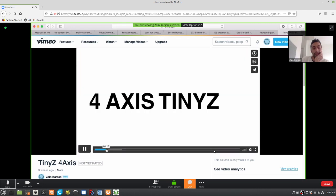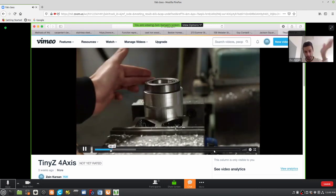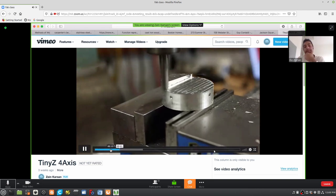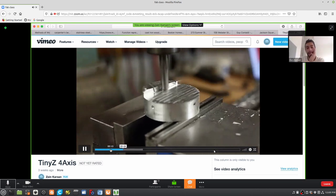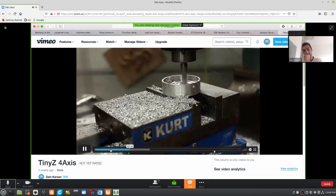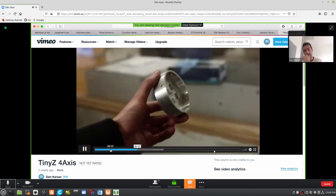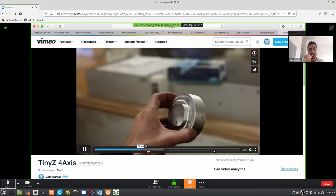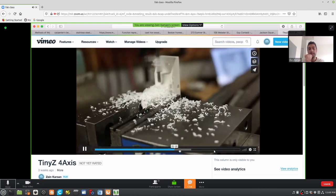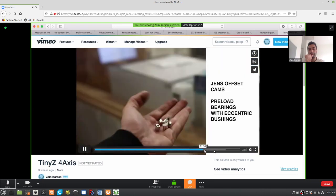So this is taking the bed of the machine. Oh, okay, so there's a preamble, which is if your 3D printers stop working, you can always just machine your parts out of aluminum. I probably should have done this out of HDPE, but in any case, the flexures from Clank don't really work in aluminum, so we machined some very nice eccentric bushings based on Jens's design. We machined some 3D prints that didn't work with the new design. A lot of aluminum milling. These are super sweet.